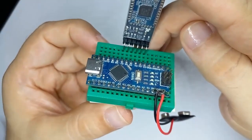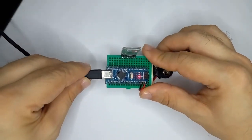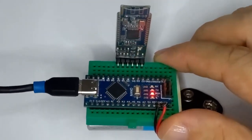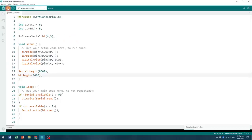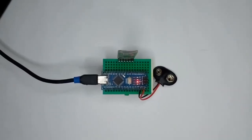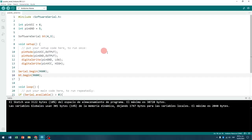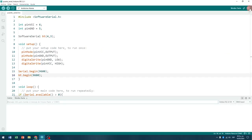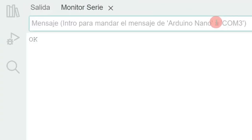On a breadboard, I will connect the HM10 module to a small Arduino-compatible nano board and connect it to the computer for programming. At boot time, the module starts by default in AT mode, or command reception mode. From my computer, I will upload to the Arduino board the bridge code shown on screen, which allows my computer to communicate with the HM10 module via serial — the code is linked in the description. Once uploaded, I will open the Arduino serial monitor and type the command AT to verify it responds OK, confirming the connection was established.